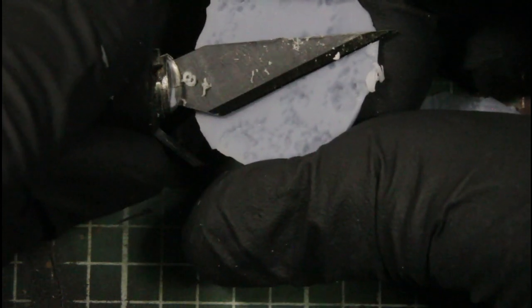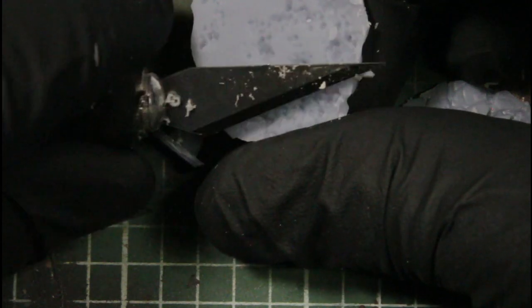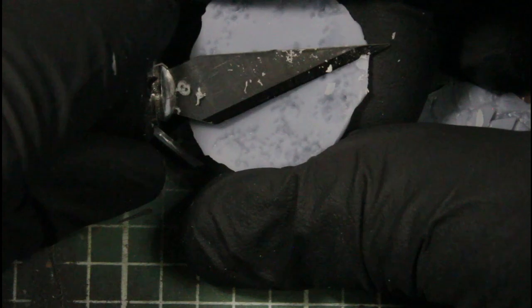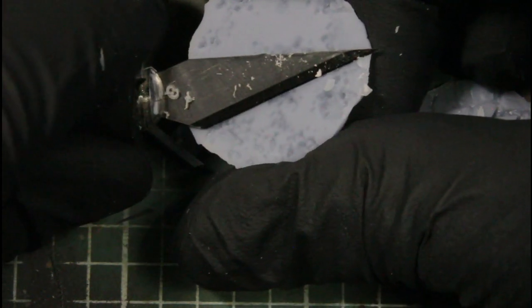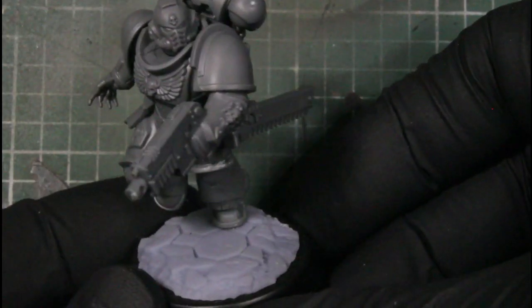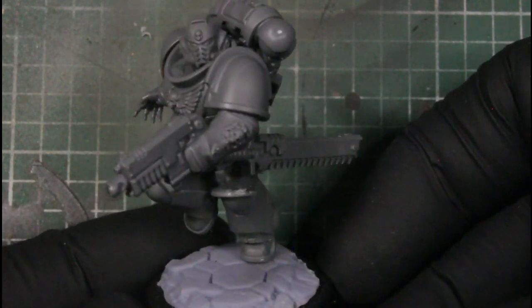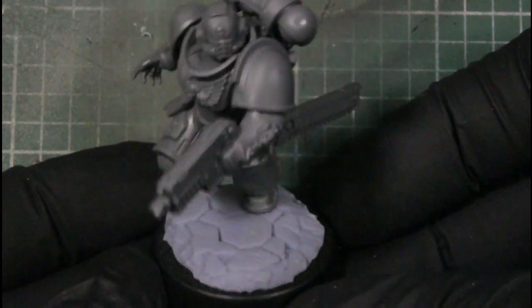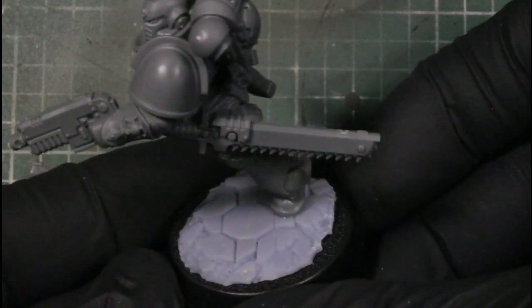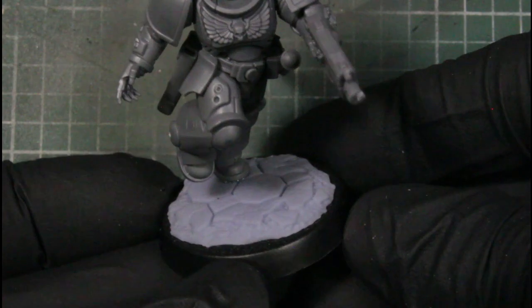But with the orientation of the way they have to print, see, if I printed them horizontal, which I tried a couple times, it's just too much to pull off the bottom of the vat, because this printer prints top down, and so the pieces stick to the print bed that goes up and down on a z-axis. And so I had to do it sideways, that way it's not pulling too much out of the vat.